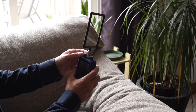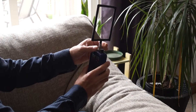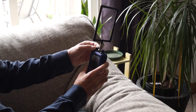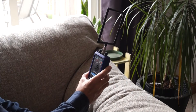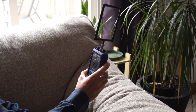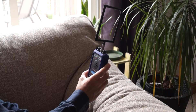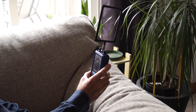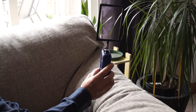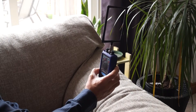With the AR1 on, adjust the antenna position so that it has no feedback. Adjust the power and volume controls until you can hear the clicking in the background — that's the distant clicking of lightning bursts, perhaps 1,000 kilometers away. By rotating the unit, the electromagnetic interference will increase or decrease, so find the place where that interference is minimum.